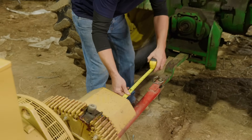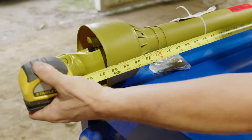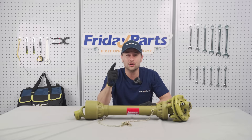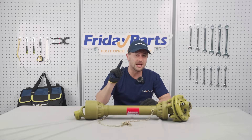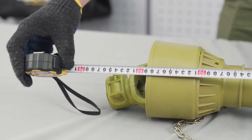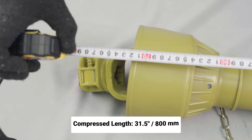First, size is not close enough. Even an inch too short, that PTO shaft could snap clean off under load. So before you buy, you gotta triple-check these specs. Here's what you need to check: step one, measure your shaft's length from center to center at its shortest position. Step two, confirm your shaft details.